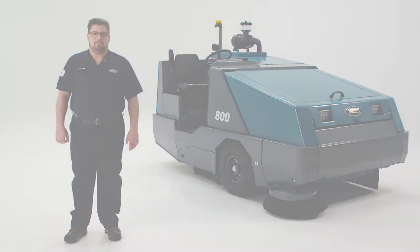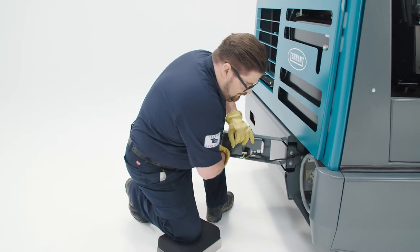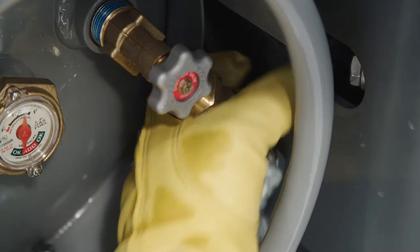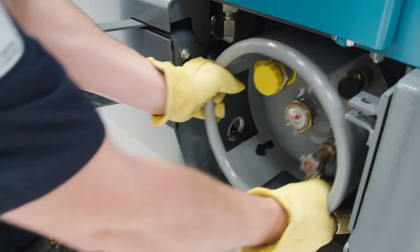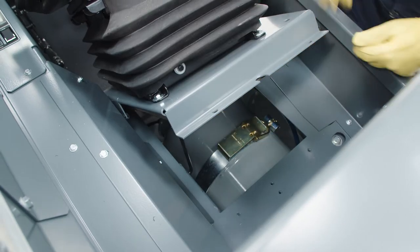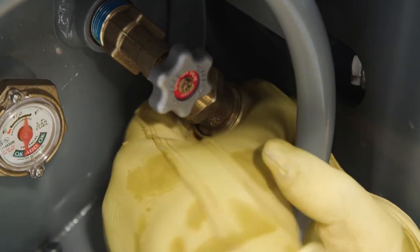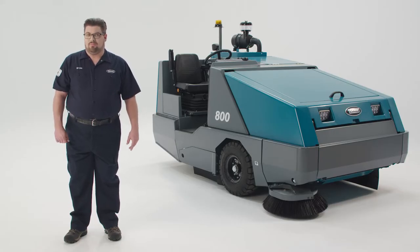Check the fuel level. If you need to change an LPG tank, park the machine in a safe area and access the tank located under the operator seat. Close the tank service valve on the tank and then operate the engine until it stops from a lack of fuel. Set the parking brake. Now you can remove the quick disconnect hose, undo the tank hold down clamp, and remove the empty tank. Put the new tank in so that the tank centering pin centers the aligning hole in the tank collar. Fasten the tank hold down clamp to lock the tank in position. Connect the fuel line to the tank, making sure the connections are clean and undamaged and everything fits properly. Finally, open the tank valve and check for leaks. If you detect a leak, immediately close the valve and contact the appropriate personnel.